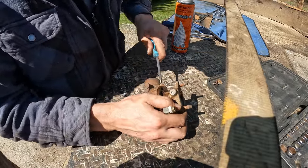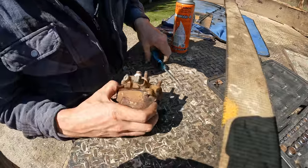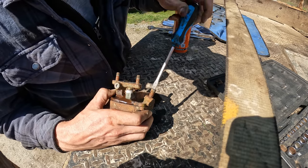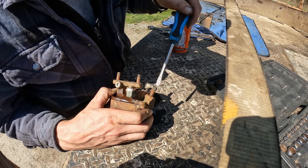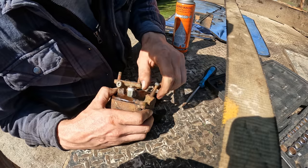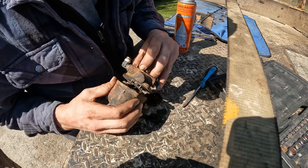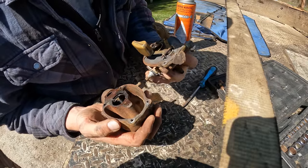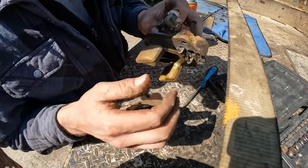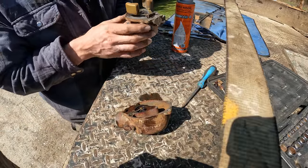See what's behind door number one here. Of course, the first thing I do is jam the screwdriver in there. Probably just broke something. I think the main needle has to come out of this to separate the halves. Hopefully I didn't just bend that thing. I'm amazed. This carburetor looks spotless aside from a little bit of rust and some stuff in the intake here. Float's not gummed up at all. Well, no. A little stiff, if anything. I cannot believe this.